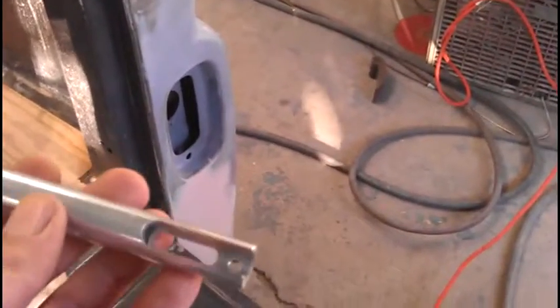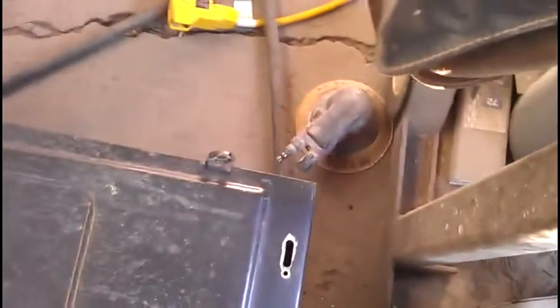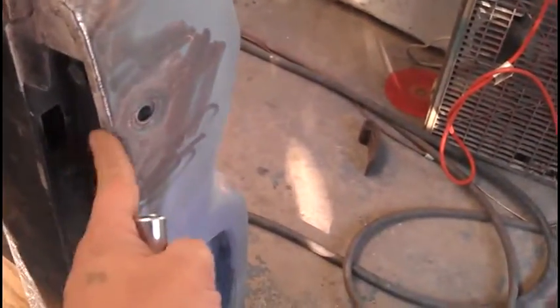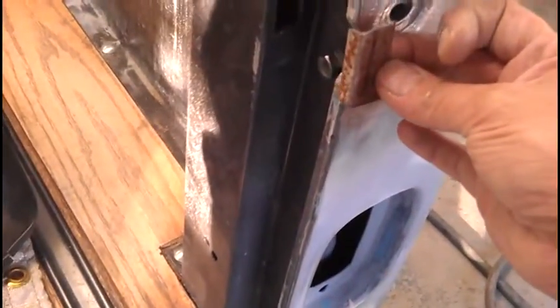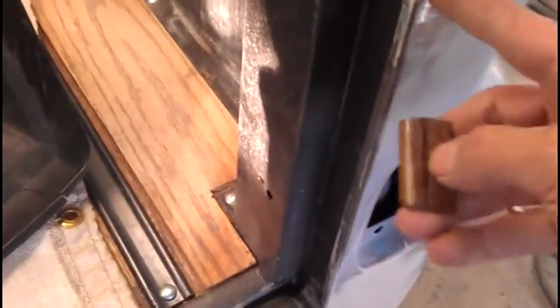Here's a piece of one, but you can see the way I had to cut it out and we're still in the process of installing the actual latches and stuff. I want to show you guys how I need to cover this indention right here and make it flat. So what I ended up doing was cutting a piece of steel the length of the jam, and then I took it over to the vise there and bent it in order to get this side lip. You can see I marked it right here and I'm going to go cut it.